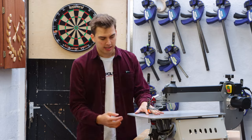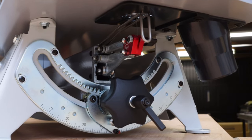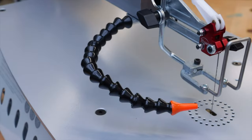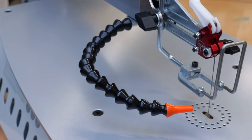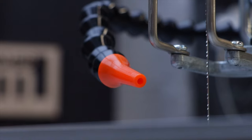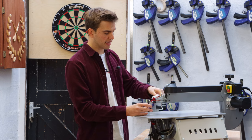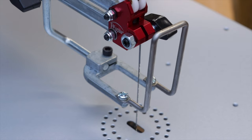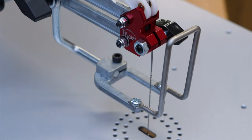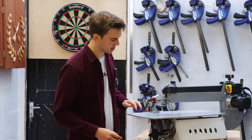While I'm on dust collection, there is a dust port right underneath the saw blade, so it's collecting all the dust right from the source as soon as it's being made. And if any dust remains on the top of the workpiece, there is a nozzle here that will blow the dust away so you can continue to see the line that you're cutting on. In this area, you also have a blade guard on the top and bottom. This top blade guard also acts as a support that you can lower and rest on the top of your workpiece, and that will stop the workpiece from lifting up and down if you loosen your grip. It's just a nice safety feature.